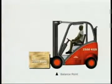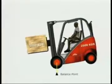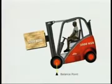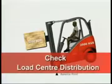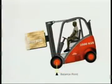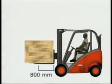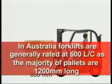Remember that a forklift is just like a seesaw. The balance point is the front wheels. So if you lift too much weight, the truck will become unstable during braking and steering. The rear wheels may lift off the ground. So ensure you check the lift height, load center distribution, and safe working load for your model. The load center distance is measured from the vertical face of the forks to the center of gravity of the load. Remember, the longer the load center distance, the less weight a forklift can carry.